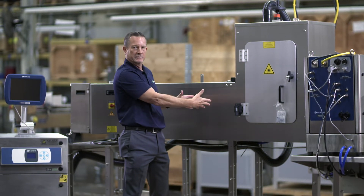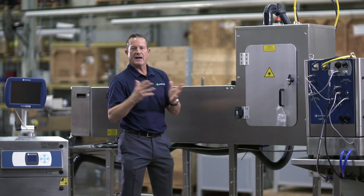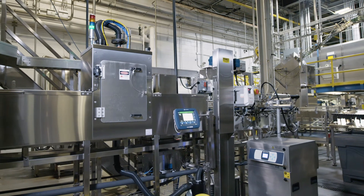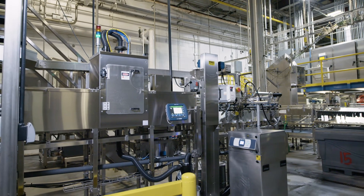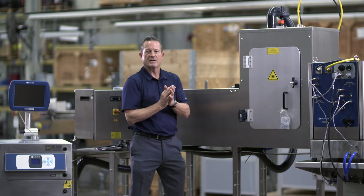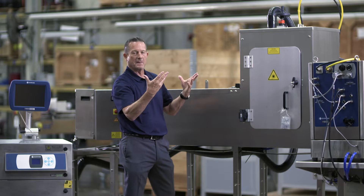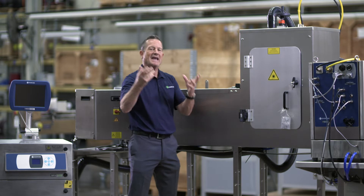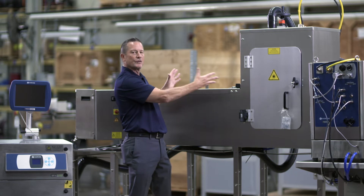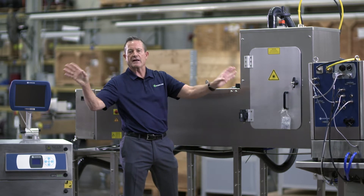The first thing you'll notice is it's metal. It's seven feet long. You may ask why it's seven feet long — the reason is entirely for safety. The guarding is seven feet so that operators with the longest arms can't stick their arms into the entrance or exit and be exposed to the energy. When you look inside the guarding, you will see baffles. What's significant about that baffle system is again safety — any reflections off the can are trapped with those baffles inside the guarding, preventing laser energy from emitting out either end.